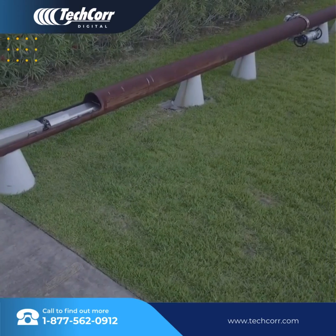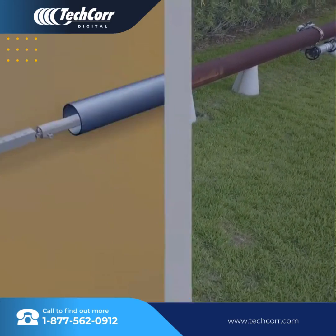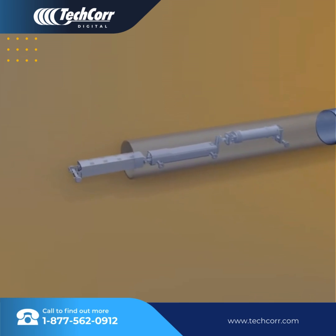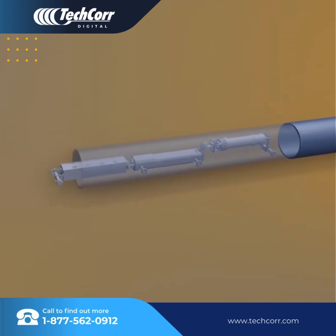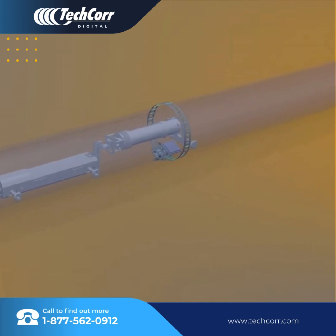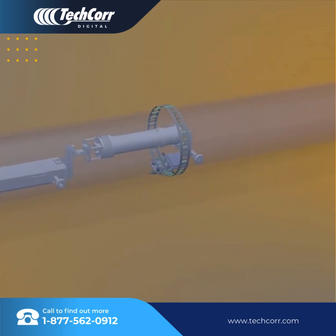The system uses a magnetic location device, which can penetrate 25 millimeters or 1 inch. There is also a gamma option, which will penetrate up to 4 to 5 inches. The stopping precision is within a 5 millimeter range, allowing for an accurate and reliable shot.